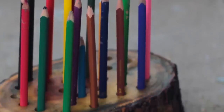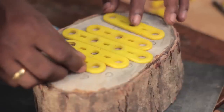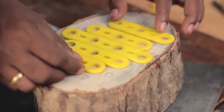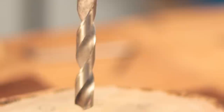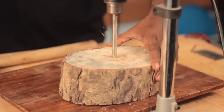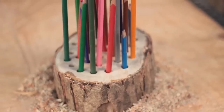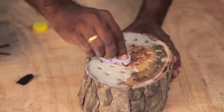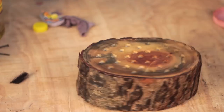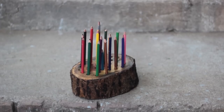The first project is a color pencil stand. Using my kid's mechanics toy, the log was marked where the holes needed to be drilled. I thought of lining them up and securing them with tape but figured it might get caught in the drill and fling on my face. Punch holes were made for the drill bit to catch — makes it a lot easier later. The drill bit was chosen to correspond to the size of a pencil, approximately 10mm. Using the drill press stand, holes were made. Once done, the pencils were inserted and it looks so cool. To make the color of the log darker, it was oiled using a rag and left to dry overnight. Then a few coats of wood polish were added to preserve the wood. With this, we complete our first project.